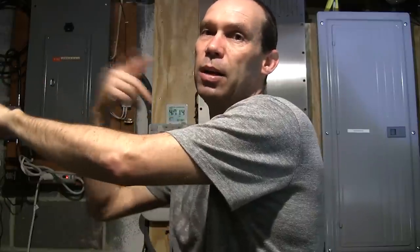If you're wearing a belt with a metal belt buckle, that can also be dangerous. If you're leaning over something and your belt buckle or your body comes into contact and you've got a good low-resistance path, you can have electricity passing through your body across your chest, which is not what you want. Ideally I would like to get a pair of insulated gloves — in a really high-energy situation they're a requirement. If you're working on a household system and don't have gloves, for the most part you want to try and use one hand where possible, to avoid an electrical path going through your body and across your chest.